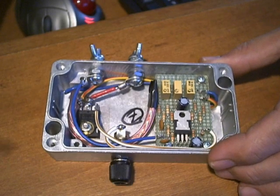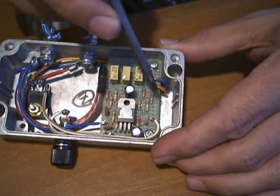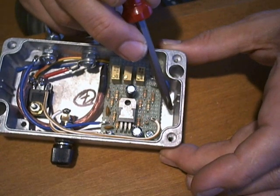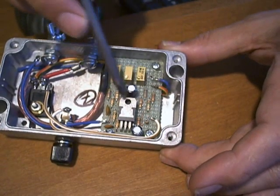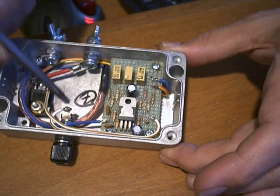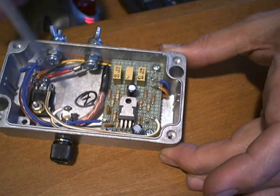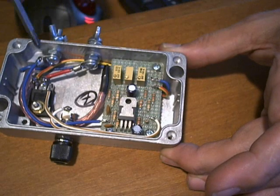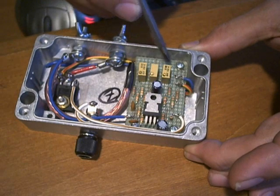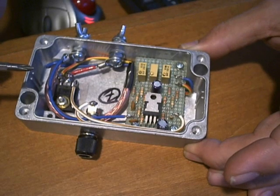Going forward you'll see that I have made a couple of small changes here. The printed circuit board is now fully rectangular — I didn't bother filling in this gap here because I don't really need to. It simplifies the shaping of the board for insertion in the Velleman G106 enclosure. It also gives me a place to run my wires underneath the board and up over the top, so that I can make my connections from this side of the box across underneath the board and then up behind the terminals on this side. It made it look a lot neater.